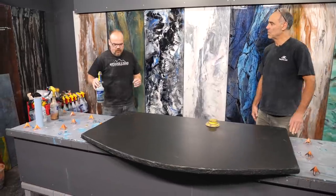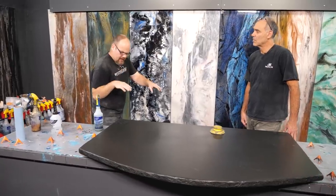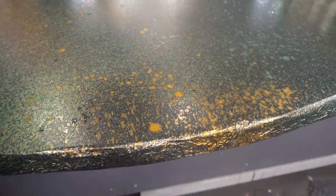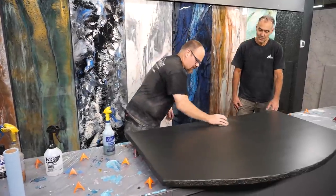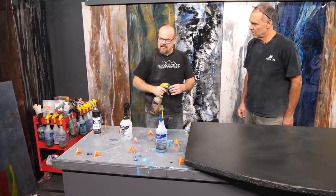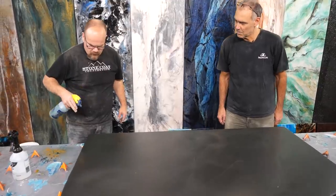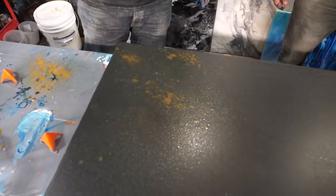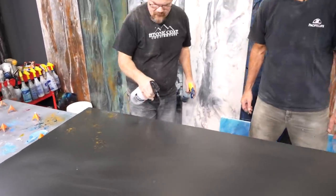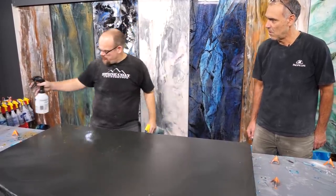The key here is getting your droplets to come out how you like them. Sometimes what I'll do is spray a little bit of clear — this lubricates the board so that when it hits it doesn't just spatter at an angle like little teardrops. It'll hit that clear and still give you circles. First thing I'll do is just do a light sand on this to get rid of any high points, then wipe the dust and we'll spritz this thing. You don't want to create a pattern — you see how I'm barely pulling that trigger? The big rookie mistake people make is pulling full trigger pulls every time.